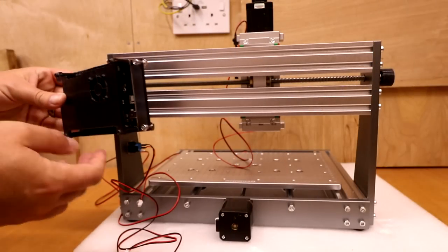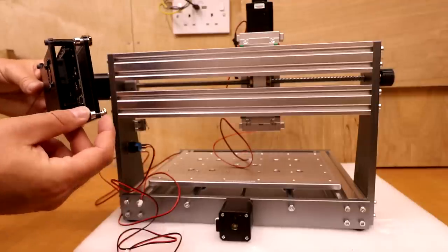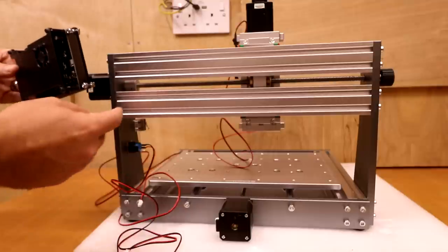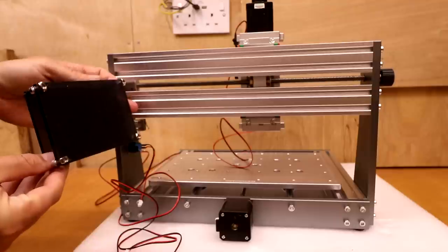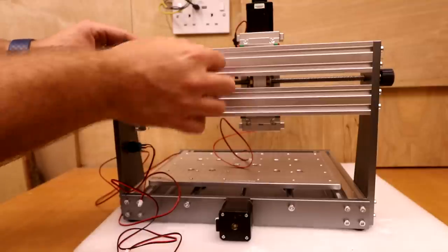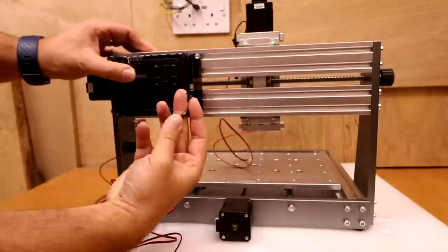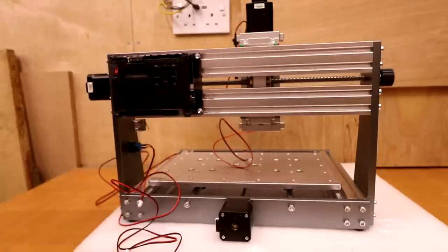To install the control board you'll need M5 10-millimeter bolts with hammer T-nuts. These can drop straight into the slot so they don't have to be slid in from the side. I find it easiest to put the nuts on the bolts about one turn, then simply place it in position — the T-nuts drop in, you push the bolts in, and as you start to tighten them it all holds itself in place. That's just a little bit easier than trying to align all the bolts and keep shuffling everything about.